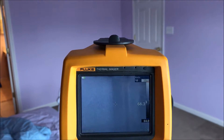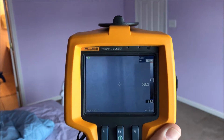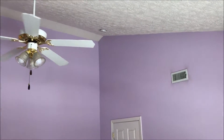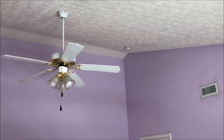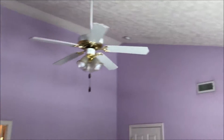I'm going to show you why fiberglass batt insulation is really not a good idea to use in your attic. In a vaulted bedroom, you've got a typical ceiling at about the eight to nine foot mark, and the attic runs from side to side. You have knee walls that go up, and typically what they do is just smoosh in batt insulation between the studs holding the drywall up and call that insulated.